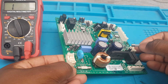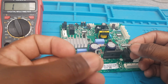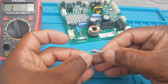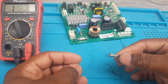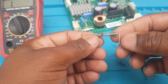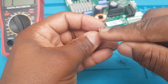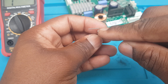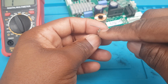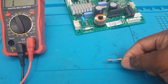If you notice, this fuse has a spring right here. What I'm going to do is use this pin and solder it to the fuse to create that pin. I have successfully soldered it — it was giving me some trouble. I had to scrape the top of the fuse and put some solder paste or flux on it in order for the solder to hold on to the fuse.